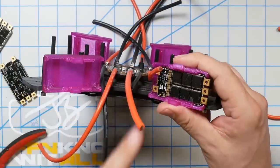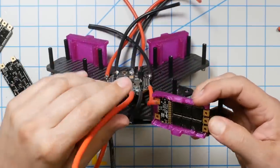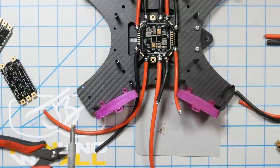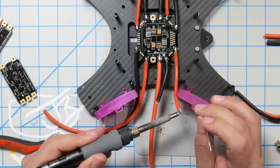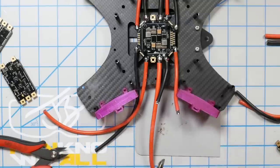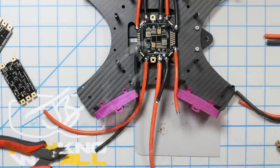I'm not going to solder this in the holder because I think I'll melt the TPU. I'm just going to solder it out on the bench. In case you're wondering, this is just a piece of silicone mat — literally a piece of silicone originally intended as a pastry mat for rolling out pie crusts on a countertop. But I cut a little bit of it and use it as a bench cover, and it's great because silicone is very difficult to melt or burn, so it's great for soldering.